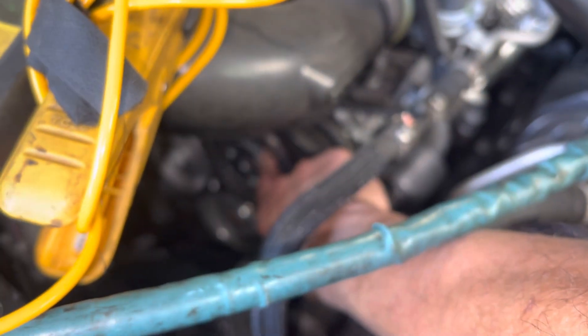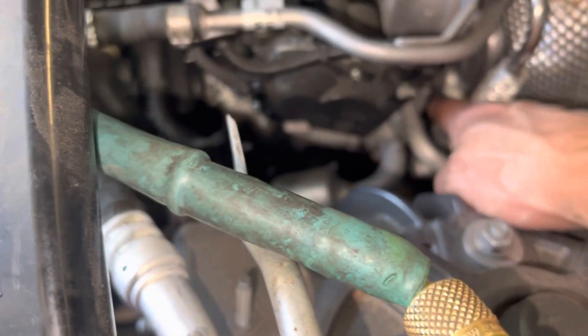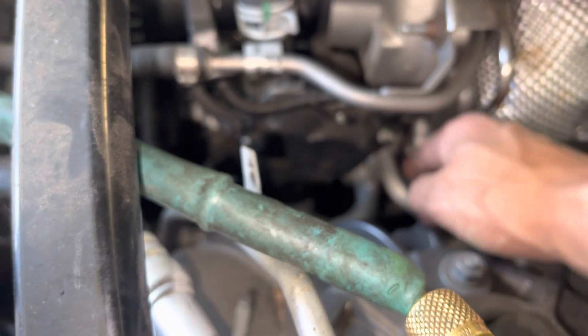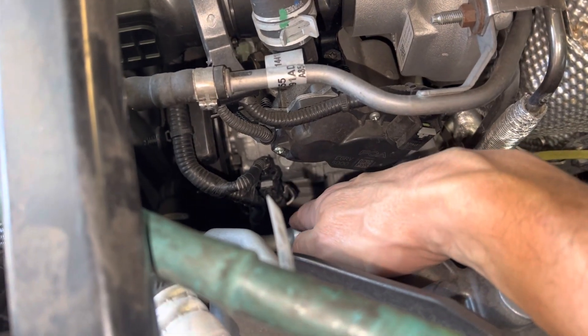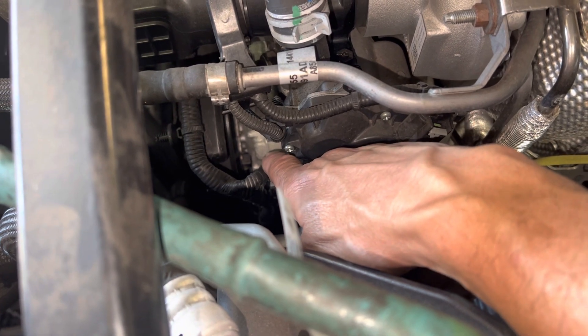Just for the refrigerant. And if we look at this small high-efficiency compressor, it does have a mechanical clutch on it. If you look at the size of it — the front head here is about three-quarters of an inch, 19 millimeters — that's actually not the compressor itself, that's just the front head that holds the bearing and everything up front. The rear head at the back is just a cavity for bearing support for the shaft, and for the suction and high-pressure discharge line. The actual compressor falls in between — right where you see this wiring harness, there's a little seam, a little line — that's where the compressor mechanics actually start.